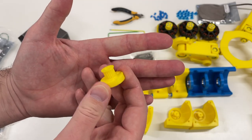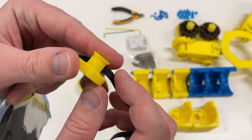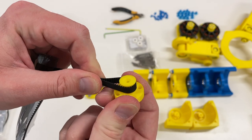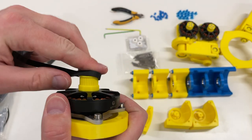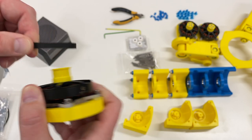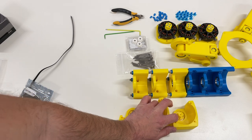This is the original pulley I planned to use, but I decided to use one with a bigger diameter. Because the pulley is 3D printed, the teeth are not perfect and the smaller one slips quite easily. The bigger diameter one is way better — it still slips, but not as easily. The best solution would be a machined aluminum pulley, but I don't have one.